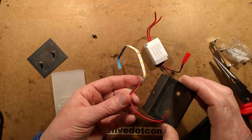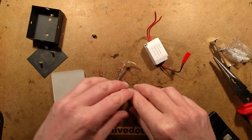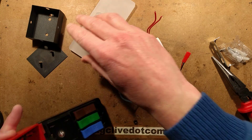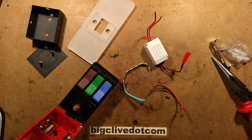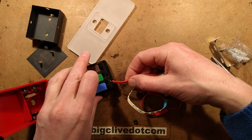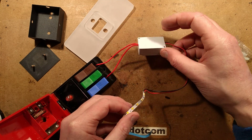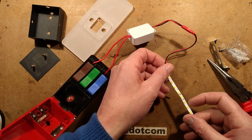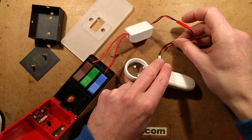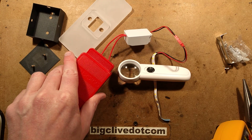It also has that little extra excitement of poking around with live stuff. The tape passes through this hole — that's also quite clever, it's very modular. Let's bring the power supply back up again. Quick test — meter on standby. Let's plug this together, hopefully get the right polarity. Keep in mind that this might not be isolated from the mains, but given its construction — the metal plate and everything — let's presume, as always, it's wise to treat it as if it's not. Just as a precaution. Let's measure the voltage across those bits of tape. Ooh, it's bright!